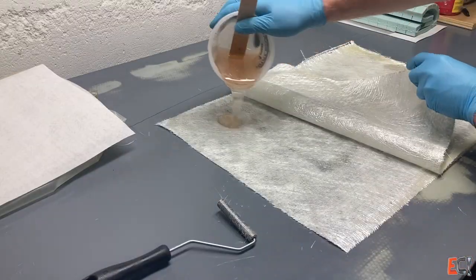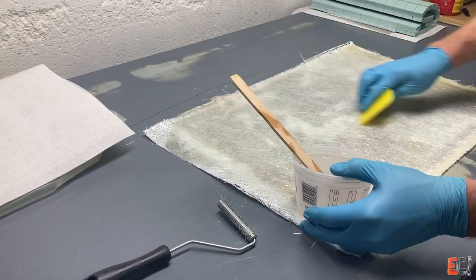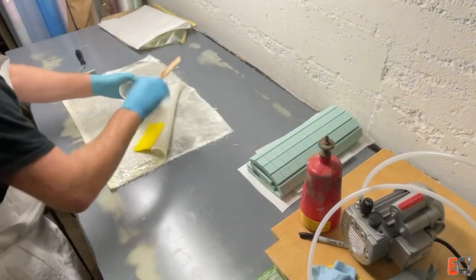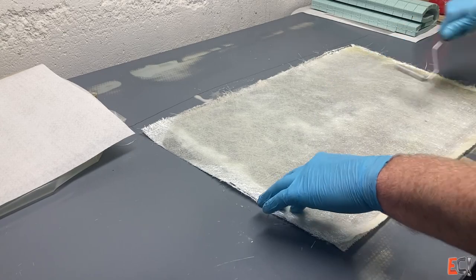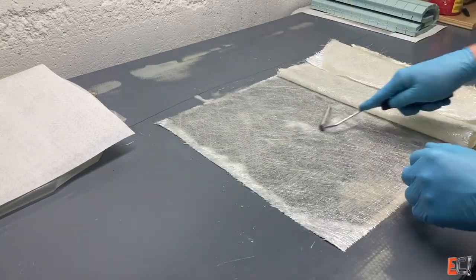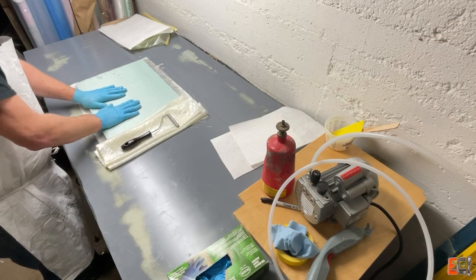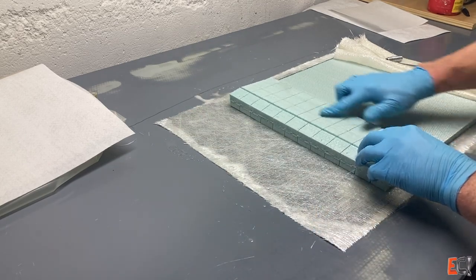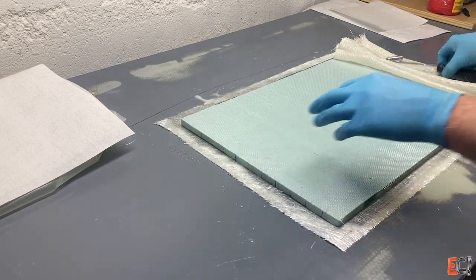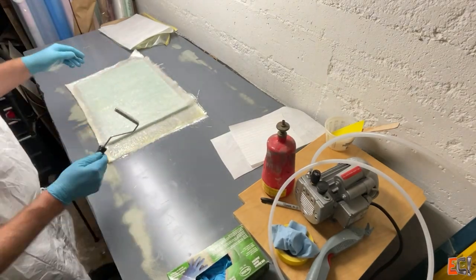Here's the extra batch of resin. I'm going to wet that through and give it a good roll to make sure I've got enough in here. I'm not going to wet the core — I'm just going to get enough resin in the skins. Part of this, in combination with the next video which will have the infusion sample, is to show how much resin the core kerfs take up. So here I'm purposely not filling those core kerfs, although in a real situation you'd probably want to use some putty or something like that to fill those in. Here's the foam. Place this down, curve side down, as you would if you were bending it into a sort of a concave surface — you can see the contour cuts there. The squares on the contour scrim are 30 millimeter square, so it's quite conformable. I flop the top skin back down on top and just give it a quick roll.